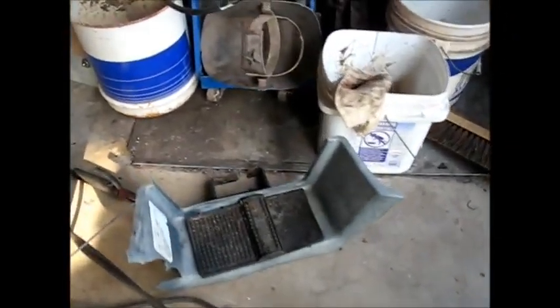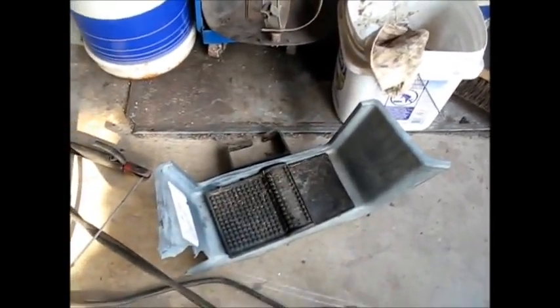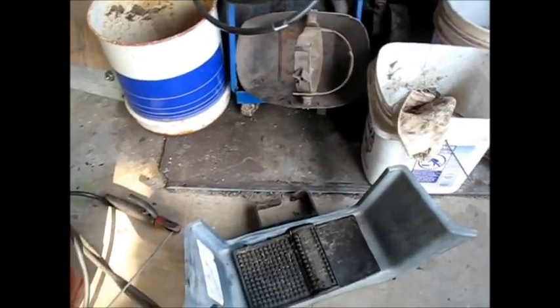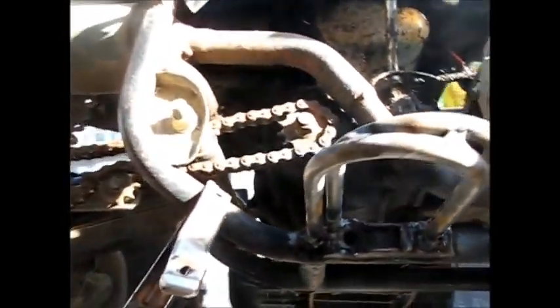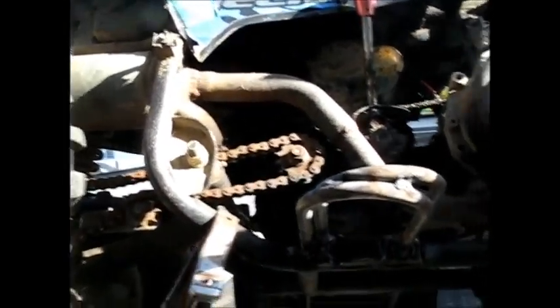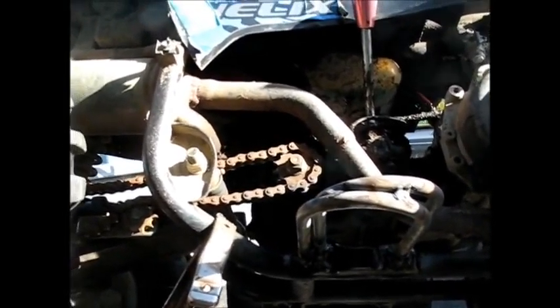Here's what I wound up doing. I was using these old pegboard thingies that came off there, but the metal in them was really cheap — you could tell when you ground it. The grinder just walked right through it and you could bend it with a hammer; there's really nothing to it. So I had a couple of old axle brackets here and I thought I'd just make a new set out of those. I welded those right in there — two of them, top and bottom. I believe that'll stay put. If I can find two more, I'll put them on the other side.